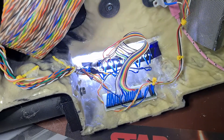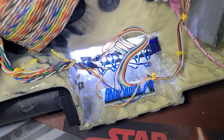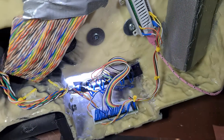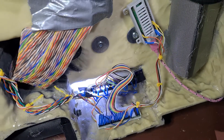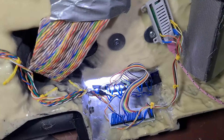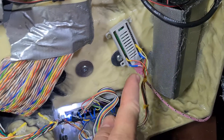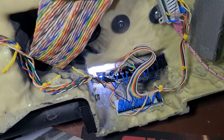There's one other advantage: the Raspberry Pi, like many modern microprocessors, uses 3.3 volts rather than 5 volts, and its pins aren't 5-volt tolerant — so you can't just drive LEDs directly without something in between. Conveniently, the port expander can take 5 volts, so it does two jobs. This is all being run by a single 5-volt USB power pack. The Raspberry Pi has a little converter inside which steps the 5 volts down to 3.3 volts for itself, and also provides a 5-volt feed to drive the high-intensity LEDs.